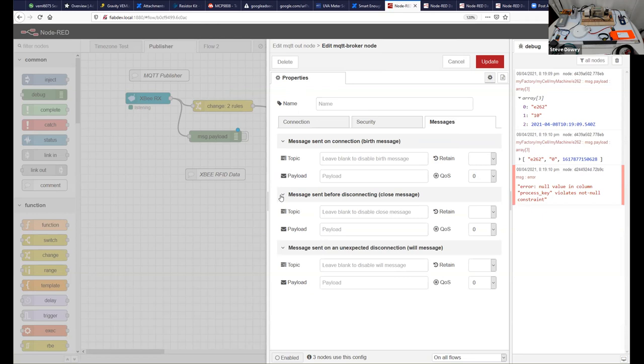The reason for that is that the broker can be separate from the publisher system. In our case, the reason they're blank is that the broker, the publisher and the subscriber are all on the same system. But if they're separated, then the broker can recognize that the publisher has disappeared and send a message that a subscriber can use to know that a disconnection has occurred. So that's where that's quite useful.